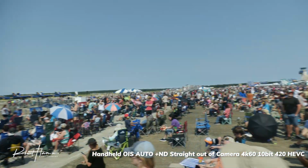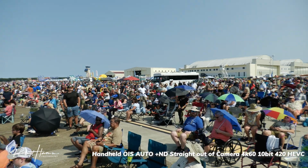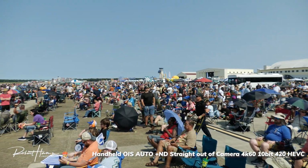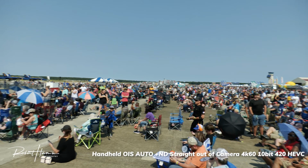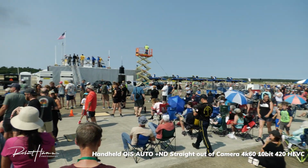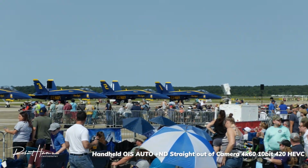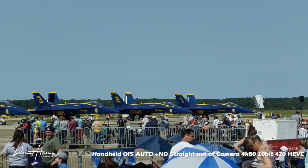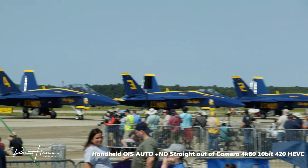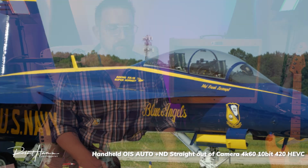I think that's a really great way to discuss it, because it gets rid of the idea that we all have of exposure, and it talks about how well the sensor can handle light. It also tells some key characteristics of bloom and smearing, something that we notice specifically in small sensor cameras like camcorders. Even a large sensor camcorder is still a small sensor at 1 inch, which isn't even really an inch, but that's another story for another day.